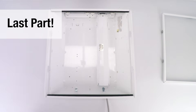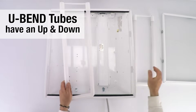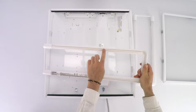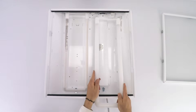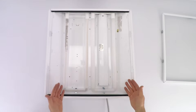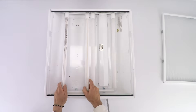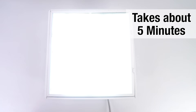This is the last part of the conversion and probably the easiest, but pay a little attention. We're going to put our U-bend tubes in the fixture now. The U-bend tubes have an up and a down. Inside the U-bend tube is a little piece of tape with a whole bunch of LEDs on it that runs down the inside on one side. If you put your tube in upside down, all the light's going to be facing up into the reflector — not very efficient. You'll see it right away; just take the tube back out, turn it around, snap it in place, and you're ready to go. Before you put your cover on, why not power it up and make sure everything's working? When you're done, put your cover back on your light fixture. It should take about five minutes to do the whole process.